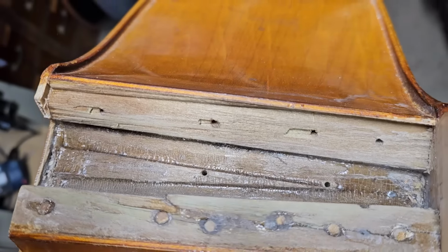Not bad. I'm measuring the threads of the screw because I want the screw to pass straight through the heel and not catch. So I'm chasing the hole I drilled with a bit that's slightly bigger. Just slightly. I want the screw to pass through there. Think of an electric guitar body. Just checking. And the threads were still catching, so I chased it with a slightly bigger bit.